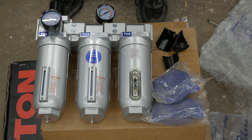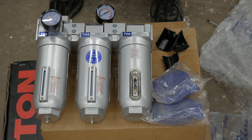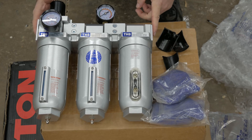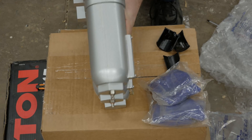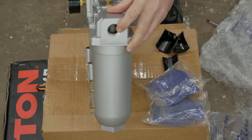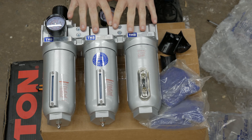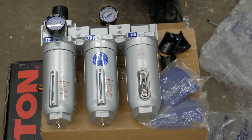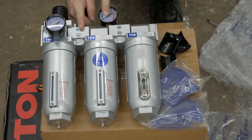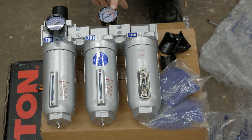Let's look at what's included in the package of our three-stage filter-regulator, coalescing filter, and desiccant air dryer combo. This is the Edge THB, three-quarter inch — it has three-quarter inch inlets and a three-quarter inch outlet. This regulator combo can supposedly flow up to around 145 CFM, so I didn't want this piece to be restricting in any way the flow coming through the system. It comes with one gauge for your regulator and one gauge for your differential pressure after the coalescing filter, to let you know if you have any stoppage once things get clogged up.